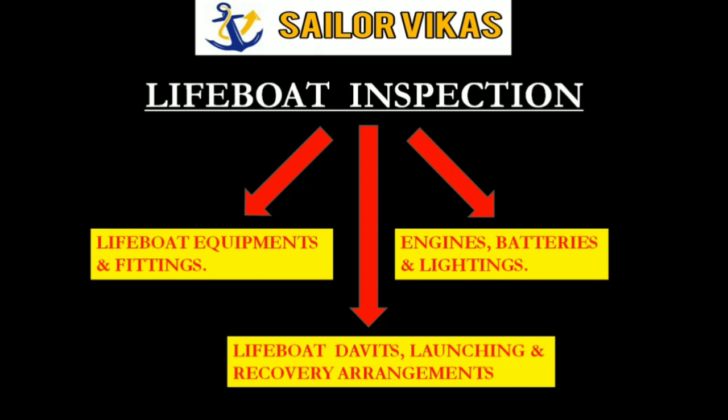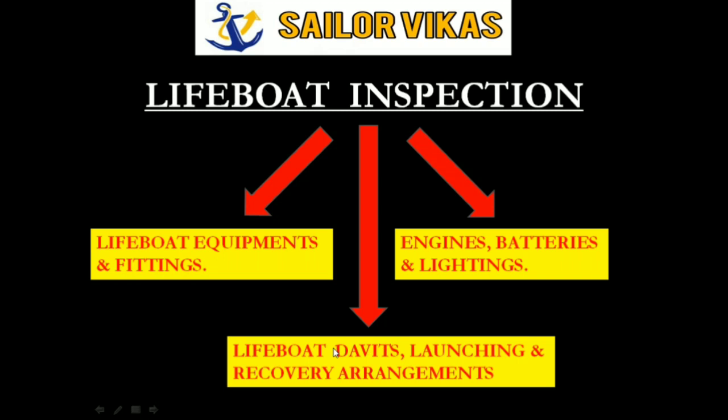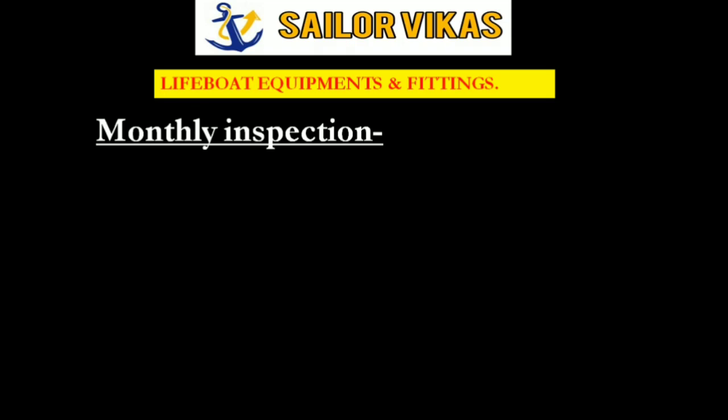The first inspection will be monthly inspection. Weekly inspection is there for lifeboat davits, launching and recovery arrangements, and for engines. We have to try out engines as well as moving from storage position. That will be done weekly, so that will be covered in that part. I'll be covering whatever is applicable to lifeboat equipments and fittings. So here I start. In this we have monthly inspection.